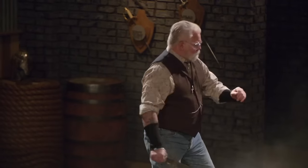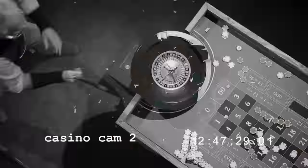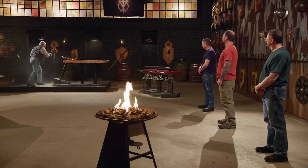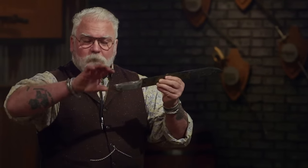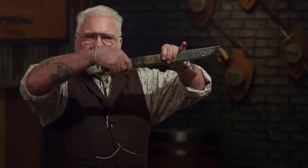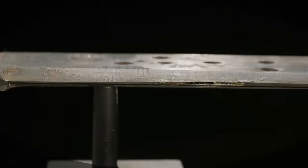Johnny, your turn. Be lying if I said yes. All right, Johnny, I'm going to start with the blade — it is sharp, it didn't take any damage. Your handle — this curve at the back on a blade this heavy, my hand tends to want to slide down on that. You did pick up a little piece of wood right there in that delamination, but nothing came apart. That looked great in the strength test. Good job.